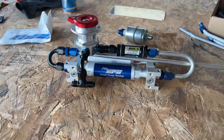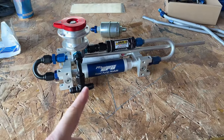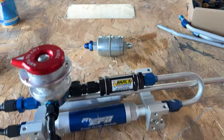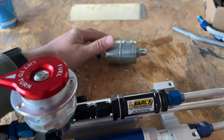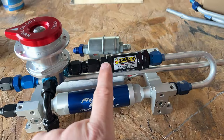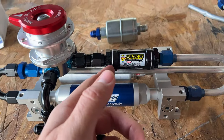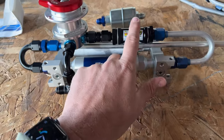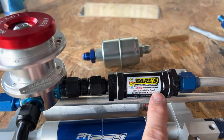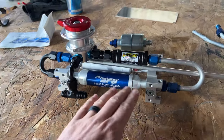And there we have it. This is the mayhem that has been going on in my head, and that only took me a few minutes to put together because I've already thought through this. I had already talked about this pre-filter right here, and the reason I'm not using it is because I wanted something a little bit lower profile. I believe that this is a 90 micron filter right here. This one is an 85 micron — it's also going to give me serviceability where the included one I would just replace. This one I can pull out and clean and put back in the system. So a lot smaller package, same amount of performance, and it's high flow. This is from Holley Performance brand, which Holley is known in the racing world for a lot of really great stuff. We're going to use that inside of this application.